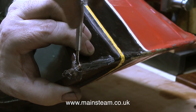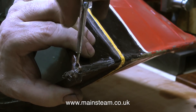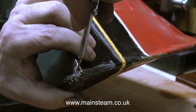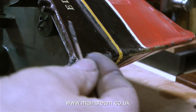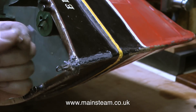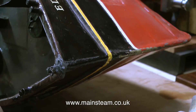In this clip I'm screwing in the 8BA bolt, which has to be quite tight to hold this part together. Because the bolt is stainless steel it's never going to rust and it's much stronger than a brass bolt, so I can really tighten it to nip the parts together. Once that's done I spend some time tidying up the JB Weld on the repair — some has squeezed out on the inside and outside — so I'm removing the excess.